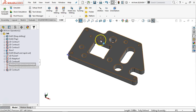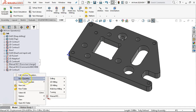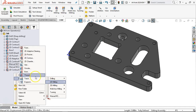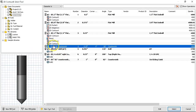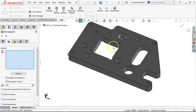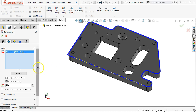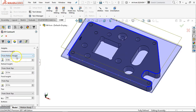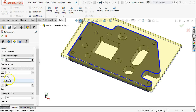I have the clamps. We already went to the outside. New operation, 2D milling, still going to be a contour. Jump back into that library, grab tool four. We're going to see if it lets me do the edge break around the outside — basically a deburr.